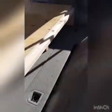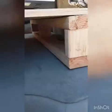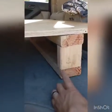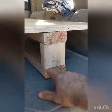It goes about to the middle line — overlapping just a little bit but it's perfect. Once you close it there's no rubbing at all. Now here's part two, all nice and leveled. For support I used a long middle piece out of 2x4 — also cut to 41 inches. To get the right height and keep it level, I measured six and a half inches: that's three and a half for the 2x4 plus three inches for the plywood, totaling six and a half.